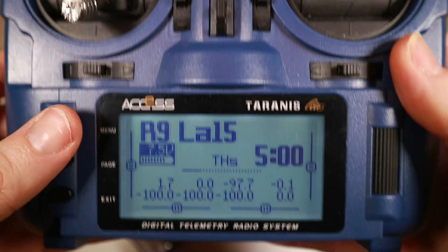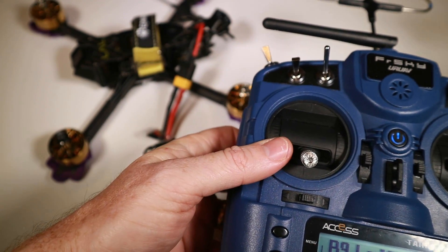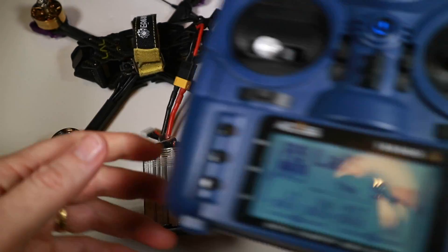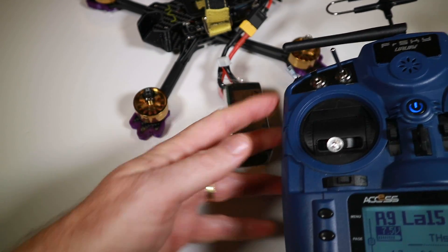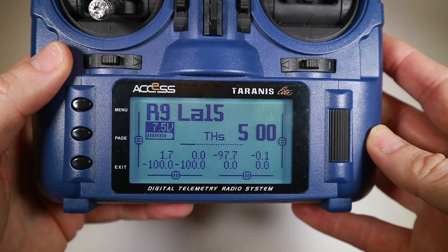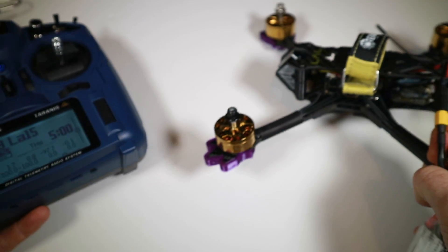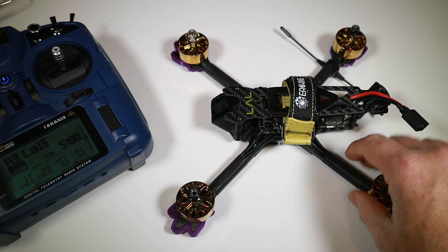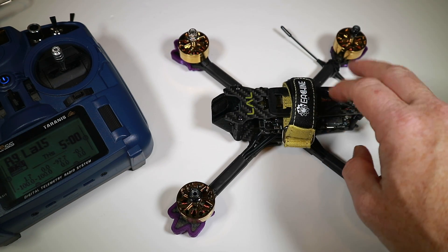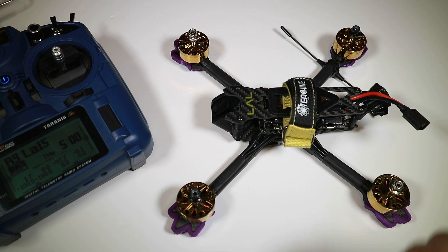Is this now as per normal? Let's have a look. It doesn't seem to respond — let's reboot. As you can see I can arm, and if I go into air mode we get motors spinning, so no need to rebind. That is finally working. Quite why it didn't work originally, I don't know, because FrSky know about OpenTX — they're a major contributor to it — so I'd expect them to have had that ready. But at least it works now. OTA updates: finally fixed — hooray! My next video is going to use another quad where we'll use F.Port, hook it up to a GPS, see if we can get that data back to the radio.